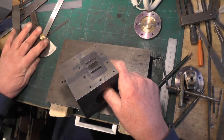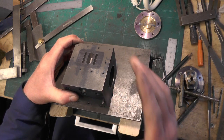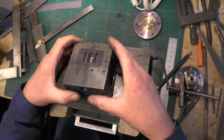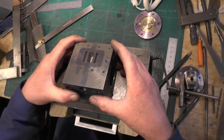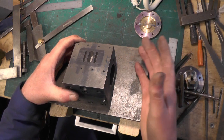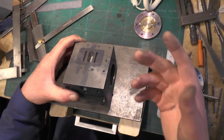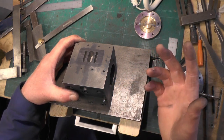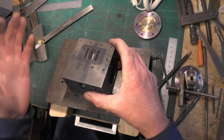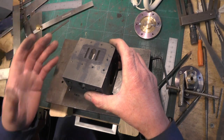Now to do this properly you need proper equipment in your workshop — an angle plate, an adjustable angle plate for your milling machine, a sine bar, slip gauges, and you need to be able to use trigonometry to work all the angles out. Not everybody's got that equipment, so I'm devising a simpler method so that anybody can have a go at it in their own machine shop.